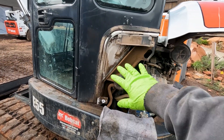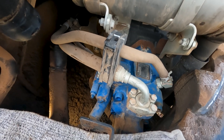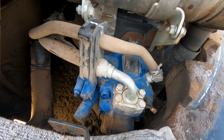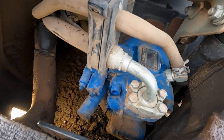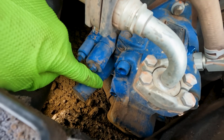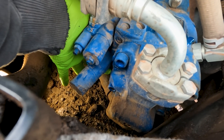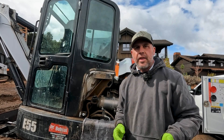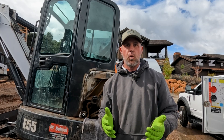I went ahead and removed this side cover here so I can get access to our pump. It's going to be very difficult to show you exactly what I'm doing, so I'm going to put a diagram up on the screen. What I'm looking for is an orifice, and I'll explain in a minute what it does. This part right here on the pump is called a torque limiter. And below that — we can't see it with the camera because it is directly underneath — right where my middle finger is moving there is a plug. Behind that plug is what we call a little throttle pintle or throttle shaft, but what it is is an orifice.